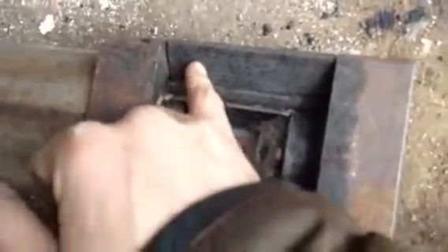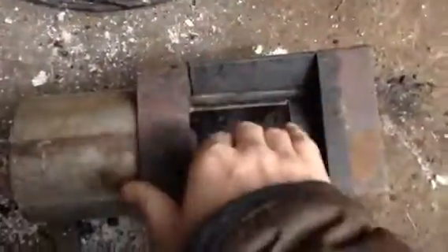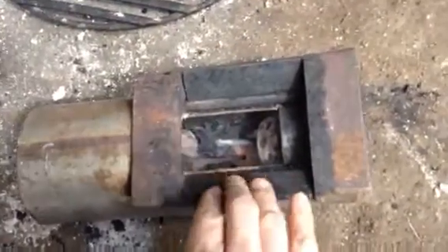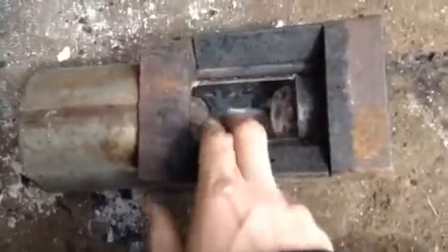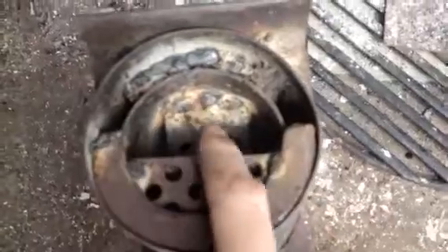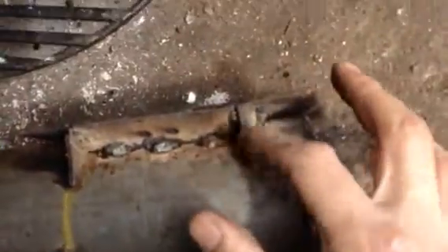It's two pipes — a three inch pipe and a four inch pipe. If you want pellets to drop down through both pipes, you've got to cut holes in both. So I cut a bigger hole in the outside pipe, and I had to weld some bolts in to separate the two chambers, because you don't want pellets falling into the four inch pipe — you want them in the three inch pipe, the burner. I sealed up most of the secondary air opening because you don't want too much secondary air. I also used L-brackets or angle iron.